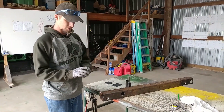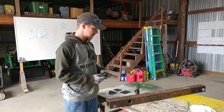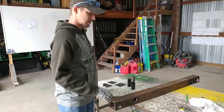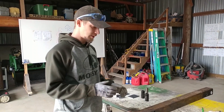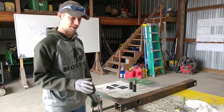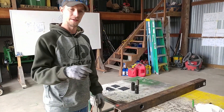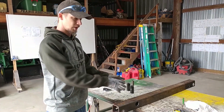We got our holes drilled, everything sanded down for the brackets, drilled and tapped for our bushings, and holes drilled in the crowd arms. Now the fun part. We upgraded the thickness of this piece of metal. With the smaller size from the plans, you'd have to make a separate bracket, but because we upgraded the size, we can cut this as one solid piece and don't have to do a couple of different brackets. Keep that in mind if you want to build this — go with the bigger size and you can do it all in one piece.